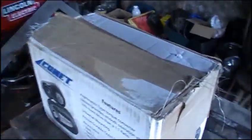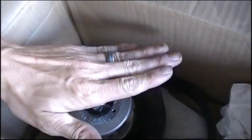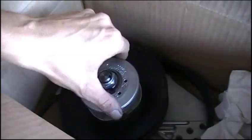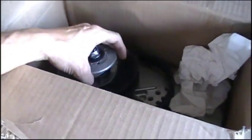You can see it right there. Everything looks pretty good. The problem I had with the old one, as I said before, is the driven pulley was warped. This one right here — the whole thing would kind of go like this, which was obviously not going to work when you spin it up to engine speeds. But they went ahead and replaced the driven pulley for me at no charge and sent it back.